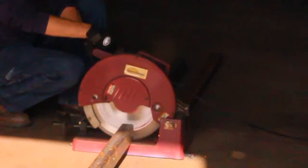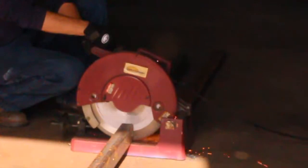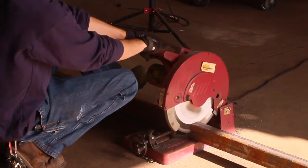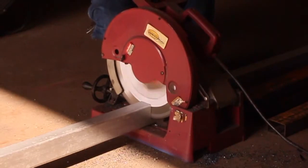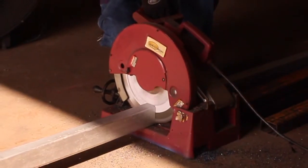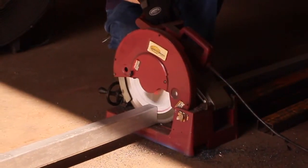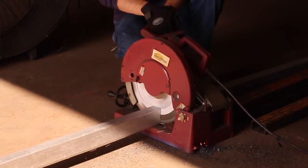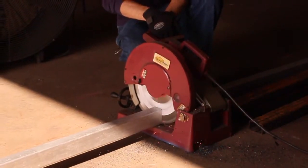First off, I took a whole bunch of this 2" by 4" rectangular tubing that I happen to have left over from several other projects, and this material here has an 1/8" wall thickness, so it's pretty sturdy. It should definitely do what we need it to do, especially after we gusset it and reinforce it like we'll be doing, but it's also relatively light, which is good because the way I've designed this stand, it has to come apart into 3 main sections with 4 horizontal cross members